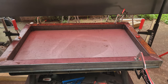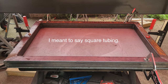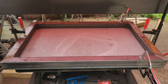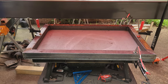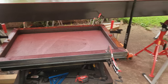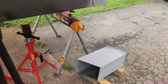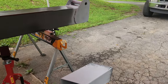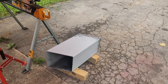And then along with this 2-inch pipe that's schedule 80, all of that together would be super heavy to muscle around, so it'll be easier if I weld the frame, get the frame on the brackets, and then mount the plate to it and weld the plate lastly. And then I can mount the base here to the plate, and then get the boom flipped over and lined up, and line up the pivot point, get the pivot point for the boom welded to the base there.